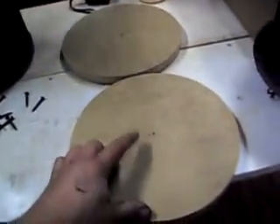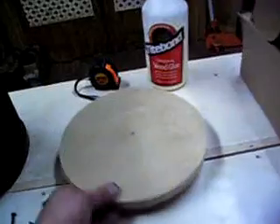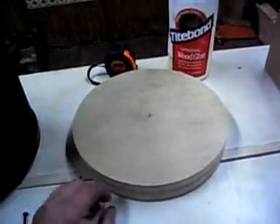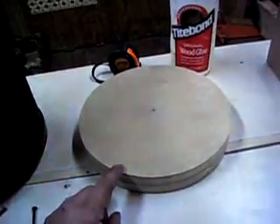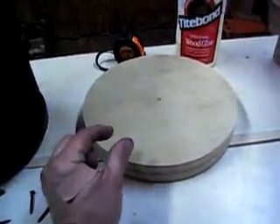So what I'm going to do is — I've got these two pieces, these were the centers cut out the last time I did a box. I'm going to take the glue and glue these two together, then I'll take my circle cutter, which has already got the pilot hole, and I'm going to cut this out. I'm probably going to sink the subwoofer — not sure yet — but at any rate I'm going to cut this out for the sub. This bottom wing will be cut narrower so it fits down inside the hole. This is a ported box. I don't know the frequency yet — I've got to calculate the airspace and the port depth and all that math. For right now, we're just going to focus on getting it mounted. I can take that port out, seal it, do whatever I want, but right now I just want to focus on getting the sub mounted.